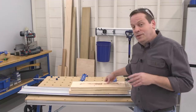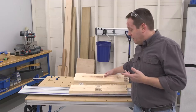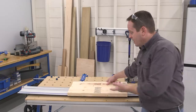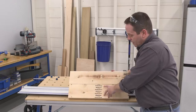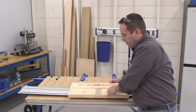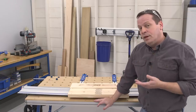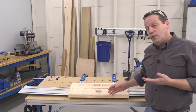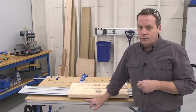A lot of projects being built these days are in a rustic style, and part of the reason they're so popular is because you can make them from inexpensive construction lumber — 2 by 4s, 2 by 6s, etc. But when you build with construction lumber, you're kind of stuck with the way it looks: you've got the rounded edges, the gaps that show up in between, and if you want to butt pieces together you're always going to have that rough look. With the Adaptive Cutting System, you can trim these boards down, get rid of the rounded edge, put a nice straight edge on them, and make them into much more beautiful boards.